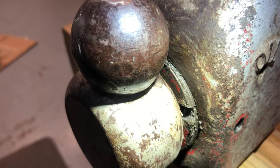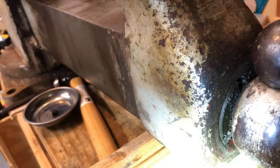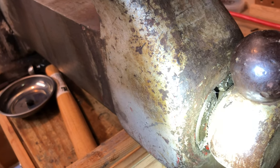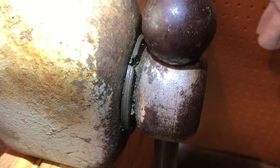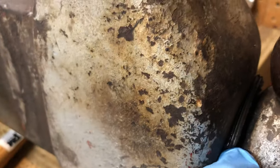And we've removed that set screw so that this retaining nut can come out. And it's a 2-piece nut. It's got 4 notches cut in it, well, maybe 2, and then the 2 spaces where the nut's been broken. And so just a little bit of light peening with a punch here makes it turn, and we're trying to finish taking that out. Thought I'd get a shot of it before I did. Alrighty, so you can see the break, and then one of the points where you can stick a punch in and work it on around. A bit of grease in here, gunk, 70 some years of sitting in the shop. And it's now freed up enough I can turn it by hand.